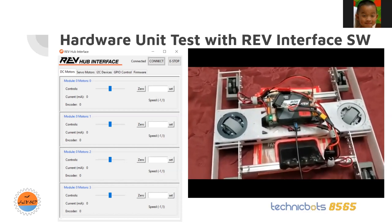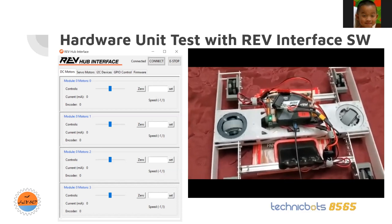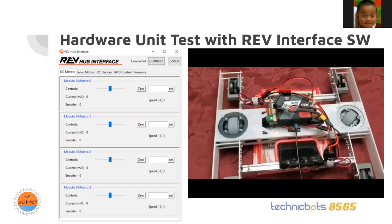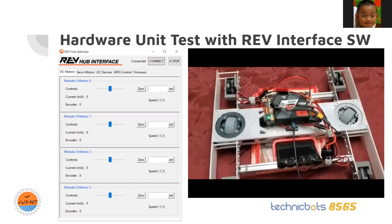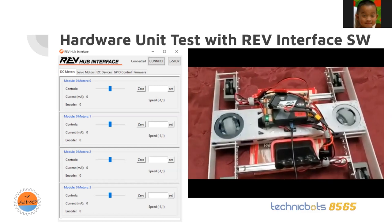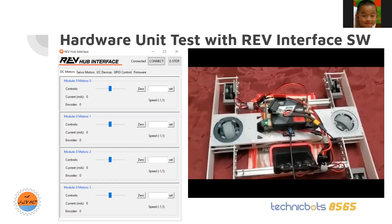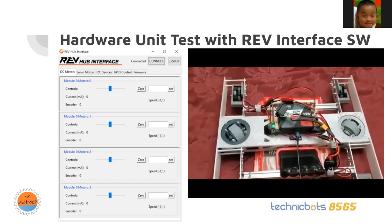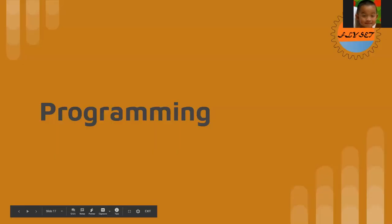After that, I made one of the motors spin in the opposite direction, so the left module was turning really fast. If I spin them with negative power — gears spinning in the same direction — the module turns really fast. This is how I tested to make sure all my motors were working and to see if I needed any changes before programming.